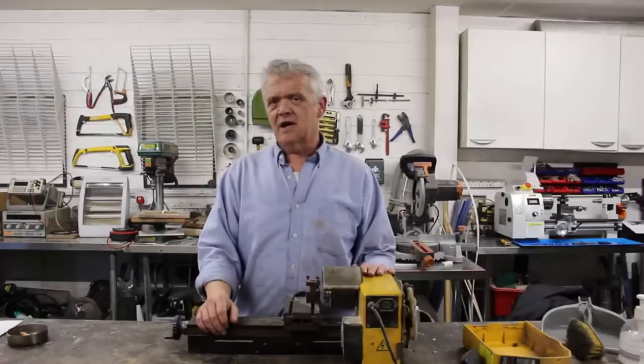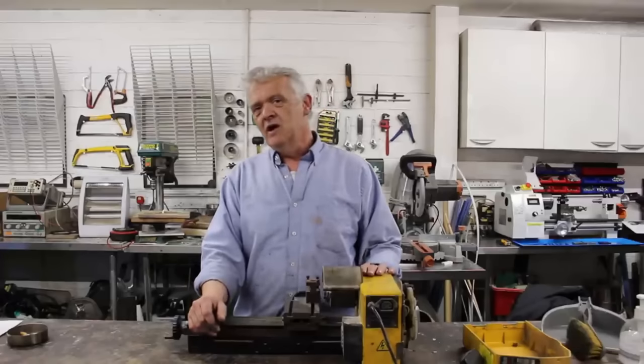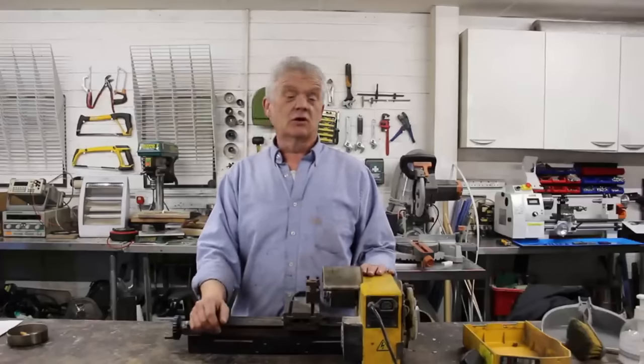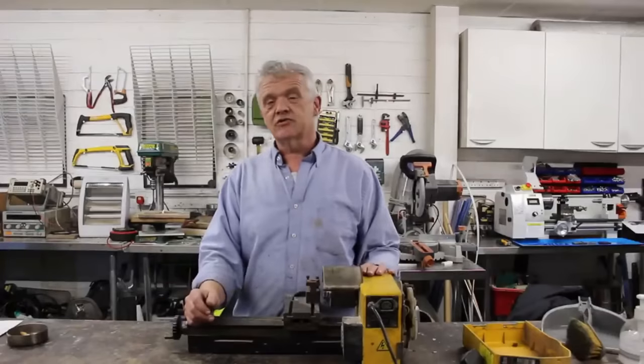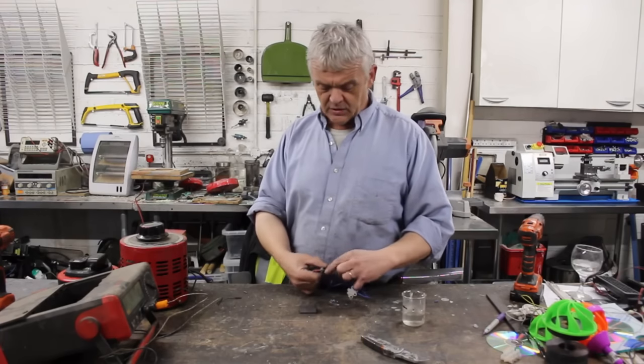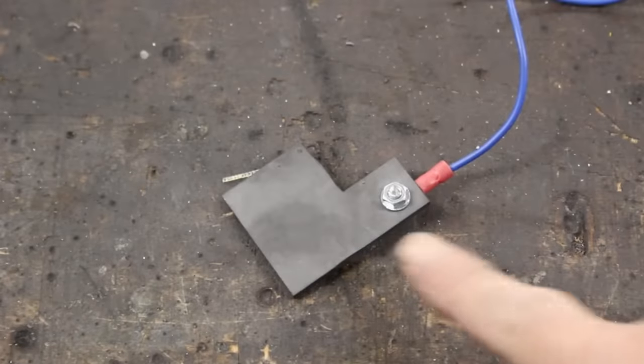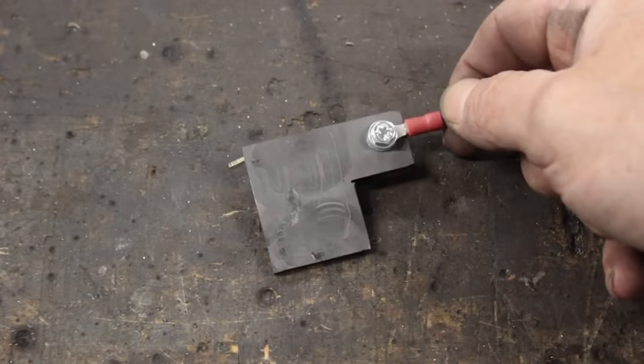The material matters. Wiseman found that when he used copper, all of the water got dirty and full of copper — not particularly ideal. If you look at the Dumas device, you'll notice it was rusting. What Heatworks are doing is using graphite plates. So what I've done is taken those flat plates of graphite and drilled them out to take a lug.